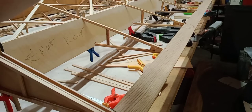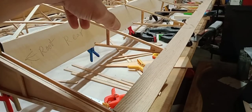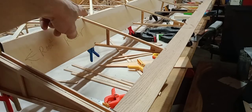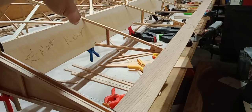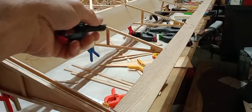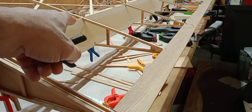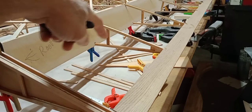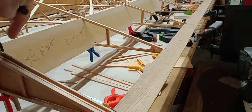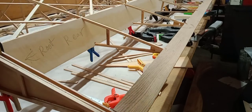We're going to put glue between the joints — the butt joints — the whole way down. When we get to the top ones, we're going to have to cut these so that they fit snugly between each rib. You don't want any gap — that's part of the glue joint. First thing is to get all the clamps spread out along there. Maybe I'll cut the top ones ahead of time and pre-fit them, dry-fit them. The bottom one just lays across the top of the ribs — you slide it in there, clamp it down, and put a clamp on the rib to keep it against the inch-and-five-eighths. But the top ones have to be fitted between each rib — so maybe I'll get them all fitted first, lay them up there, and then we can just run right through the whole thing.